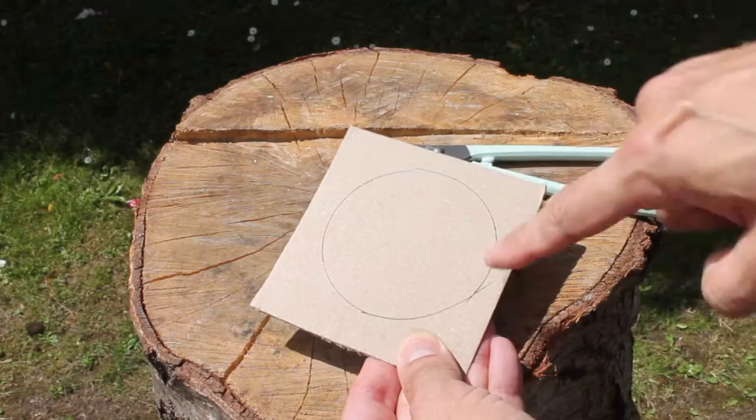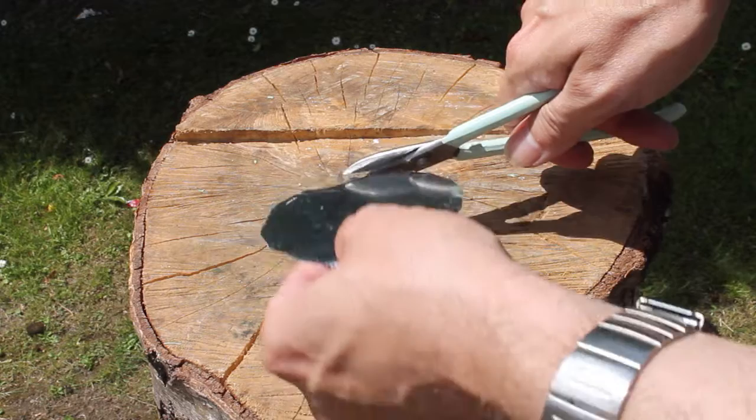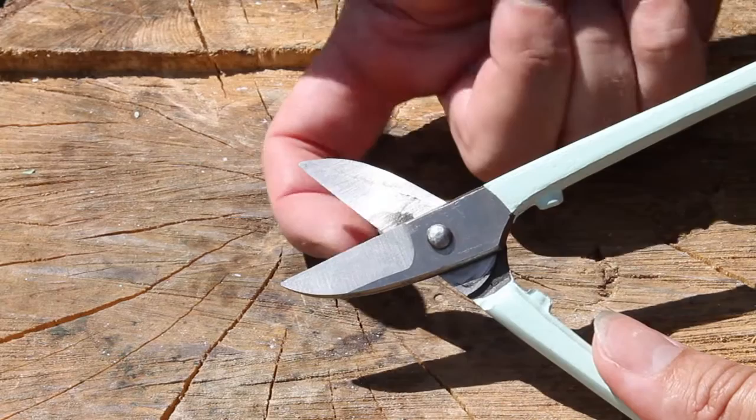Left-handed ones will be the mirror of this. Likewise, if you're cutting a circle, you may be tempted to go anti-clockwise — don't. It will be difficult and dangerous, as you're trying to bend upwards the large portion of the metal, the circle itself. Cutting it with the circle on the right — remember these are right-handed cutters — will curl up the scrap section as before, and it's much easier and much safer.